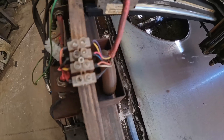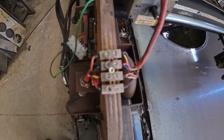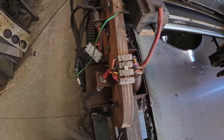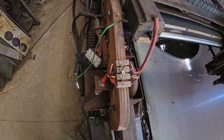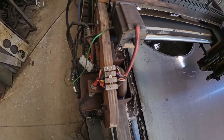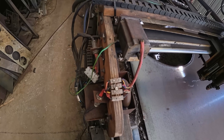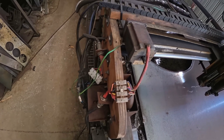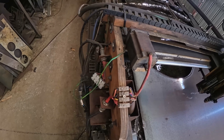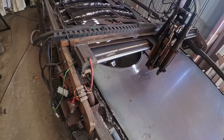I've redone wiring from time to time. What you will occasionally get are hot connections. You're putting quite a few amps through the wiring on any CNC of this size. It means you get a hot connection over time and sometimes these things will actually melt. I actually have a thermal camera, which I reviewed on a previous YouTube video, which I use to check for hot connections. It's very effective — you can quickly see where a hot connection is. It just means you end up with judder on your cut. Ultimately it'll stop working and you'll get a small fire, so it's a good thing to solve.